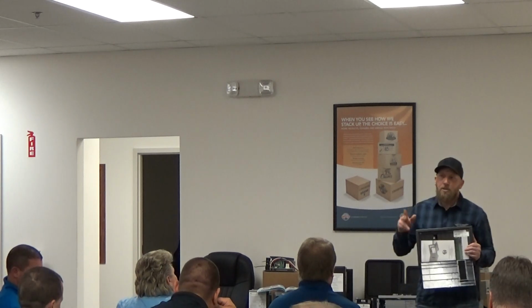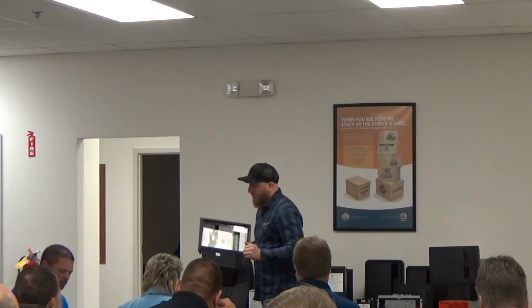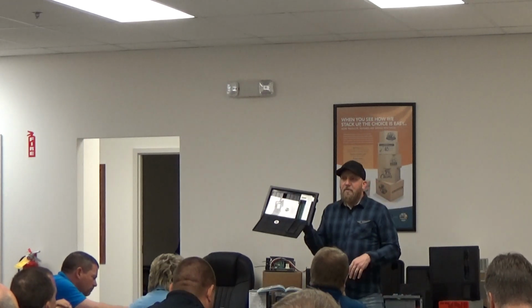You can use this for 30 or 50 amp service, but most of the time, if you're going to have something this large, you're going to use it for what it's recommended for, 50 amp service, just because there's two different legs. So if you want to use 30 amp service, you'd only use one of the legs provided inside. If people have an 893050 and they have a problem with their converter, they think they have to replace this as well. You should never have to replace this.